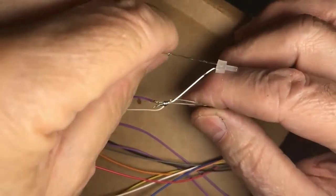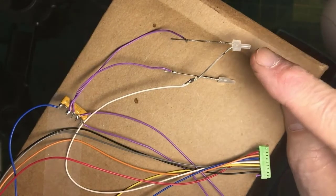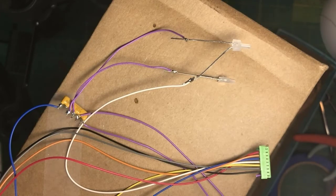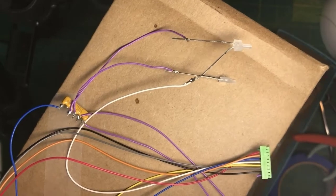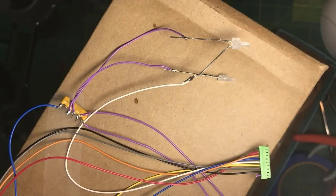And this forces us to have one resistor for each light-emitting diode. Now, you can buy light-emitting diodes where the resistor is built in, and those would share, but a plain light-emitting diode like this, one resistor per customer. That's just, unfortunately, the way these particular devices work. Okay, as it happens, I only do very small locomotives and critters, and I only do a headlight and a backlight. So I have been using one resistor, so I'm probably safe with that. You're getting away with it, but in terms of reliability, best practice is one resistor per light-emitting diode. But if you don't have the space and you're getting away with it, I tip my hat to you.